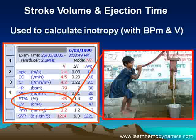How does that work? Well, imagine this little child working this pump. Every time she pulls the handle through a full stroke, she will deliver one stroke volume of water into the bucket. But it will take her a given time, the water will flow at a given velocity, and it will also be at a given pressure. But imagine now her father were to operate this pump — he would still deliver one stroke volume, but he would do it in a much shorter time, at a much higher flow rate, and at a much higher hydrostatic pressure, simply because he is more powerful.